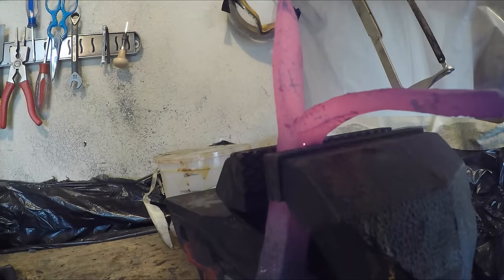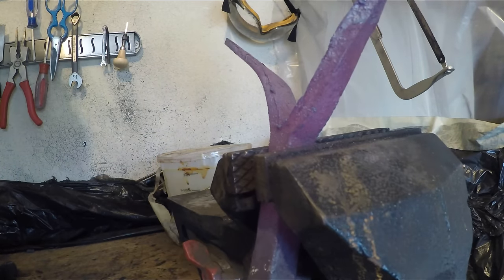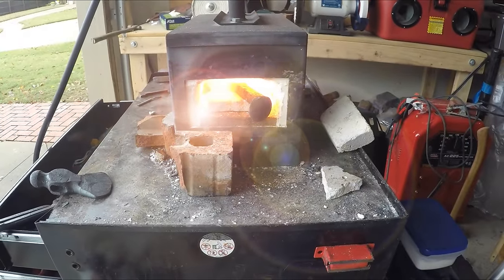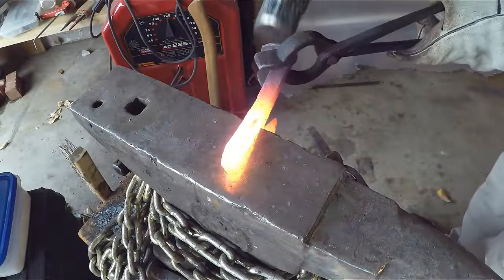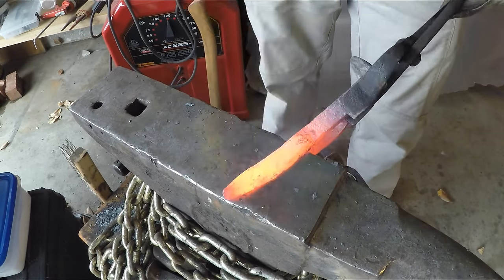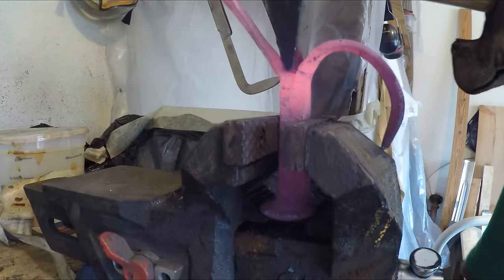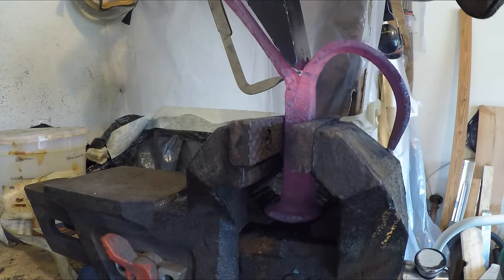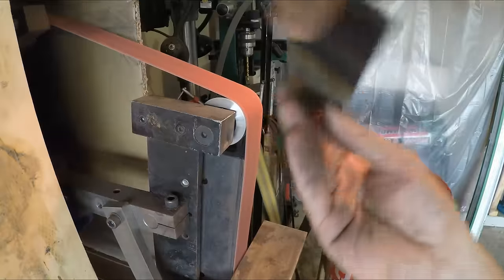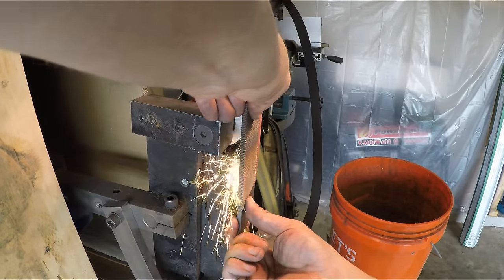I'm going to split these two legs apart and flatten them out a little bit so that there's more surface area for the forge weld to occur, and it'll also reduce the width or profile of the knife to make it a more manageable width. That crotch area in between the legs has to be hammered out — I have to have room for the width of the farrier rasp to slide way back in there. Then I'm going to clean up the inside edges with a file where the forge weld is occurring. That took forever.